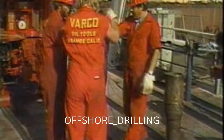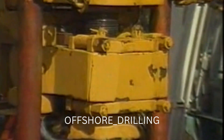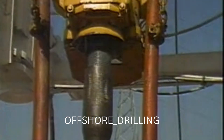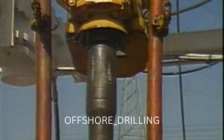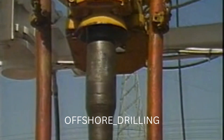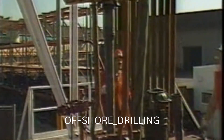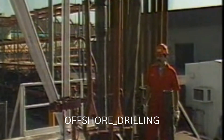When tripping, this ability to get back on the hole is particularly important should a kick occur. Before the trip, a second inside BOP is made up on the drilling shaft, and should the driller notice a flow increase or pit gain during the trip, he simply sets the slips and stabs the drilling shaft back into the string. At this point, he can close the pipe rams and read his pressures on casing and drill pipe and begin circulation of heavier mud. If necessary, he can close the remote operated Kellycock and lower the string to the floor, close the inside BOP and break off the drilling shaft to install his dart valve and steel hose. This operation does not require the presence of the floor crew to shut in the well.